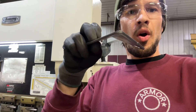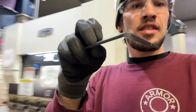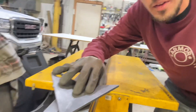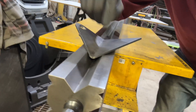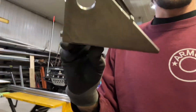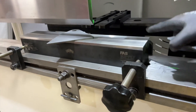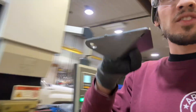What's nice is with the Rollo-V you get no deformation all the way out to that point — something you're not going to get with a traditional V die. With a regular V die, there's no support for the bend out there, so it will deform. But the Rollo-V puts constant pressure by how the dies work, putting pressure up as it goes, and you get nice clean bends all the way to the point.